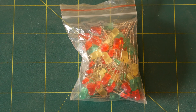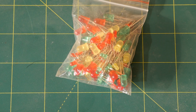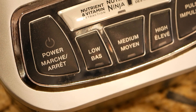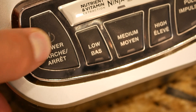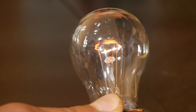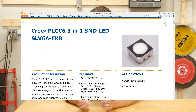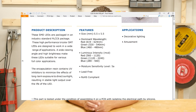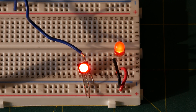Everyone assumes that these little old-school LEDs found in every traditional product under the sun are efficient. Sure, if you're using them on a TV or a blender where the LED's electricity use is negligible, then yes, they are. But for building a bright, multi-color wearable with a tiny battery, you may as well be trying to power an incandescent bulb. Fortunately, modern LED technology is a lot better. I settled on some Cree RGB LEDs — here's an old-school LED powered at 5 milliamps, and here's the one that's going to light up Joey.